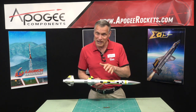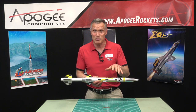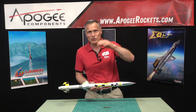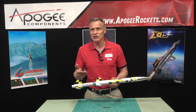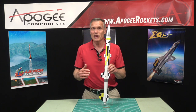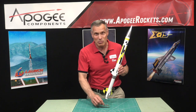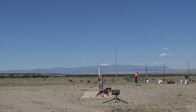If you need something that has apogee detection, get the simple timer. I know there are other devices like altimeters that will sense apogee, but this one is unique because a regular altimeter requires the rocket to pass a certain altitude before it will initialize — it does that so it doesn't get a false liftoff. A gust of wind on the pad might trigger the rocket to think it's taken off, so altimeter manufacturers set a minimum distance, maybe 40 or 50 feet, that the rocket must achieve before it arms itself. But the simple timer doesn't have that. As you saw in that video, this rocket never made it past 30 feet, so a regular altimeter wouldn't have caught it.